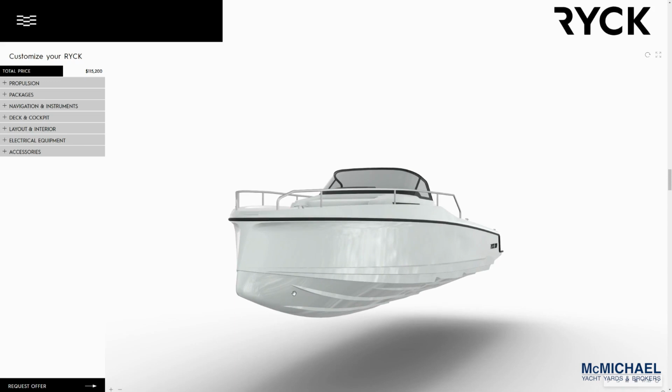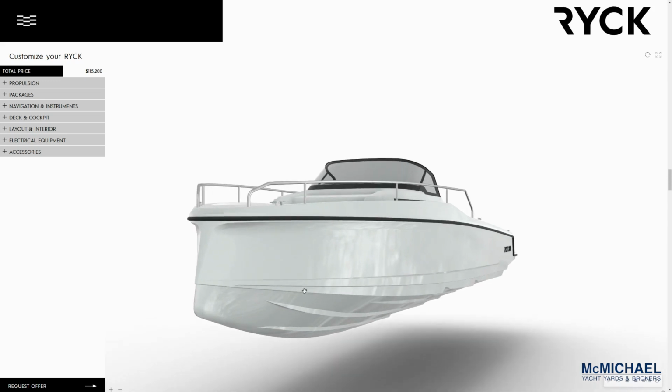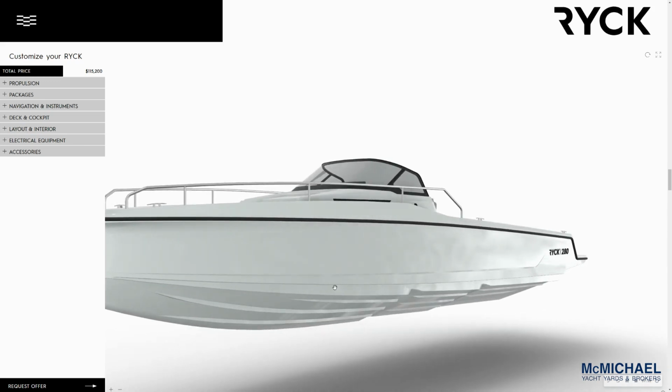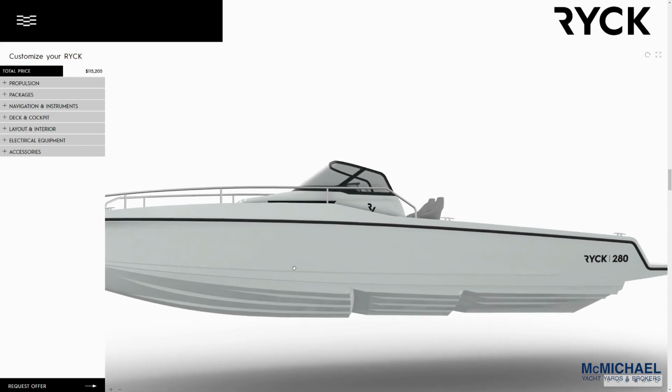So if we look from this angle here, I'll try to zoom in a little bit more, you can see that we actually have two chines. So there is a full chine that starts out reverse a little bit here and then flattens out. And this lower chine continues all the way aft. But then you can see right here, there's a secondary chine. Now that's going to help keep the water spray down. It's also going to help in turns. You'll notice that there's strakes here as well. There's two that come almost full forward, then a third that picks up over here. Now we'll talk about those a little bit more as we move aft.